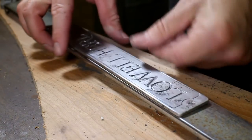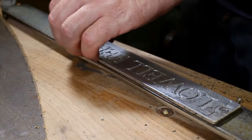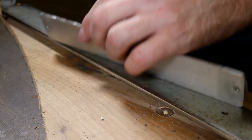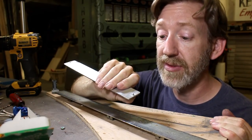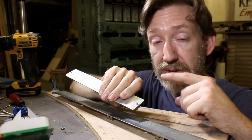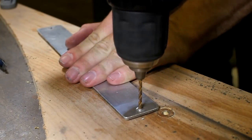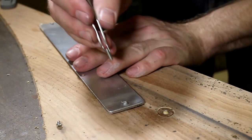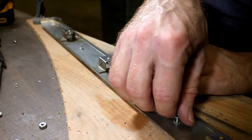Well, that would have been dumb. Nope — these holes are too big. Straight riveting didn't work, but the rivets did expand enough to stay in the holes while still sticking out the back quite a bit, which gave me a new idea. I got some number four screws, chopped the heads off, and then very carefully drilled out the center of these rivets, essentially creating a little tube. The idea was the extra depth would provide enough grip that gluing in the number four studs would hold.